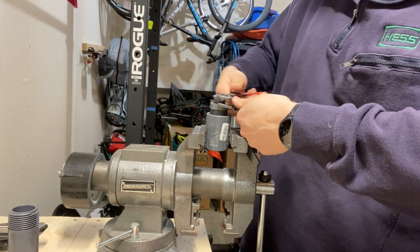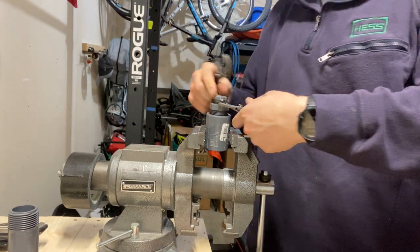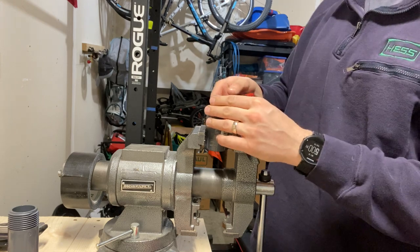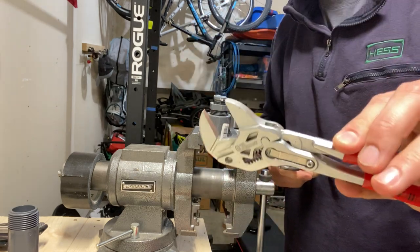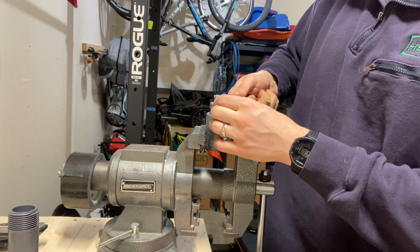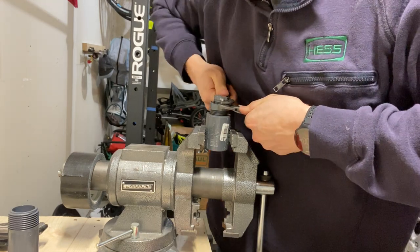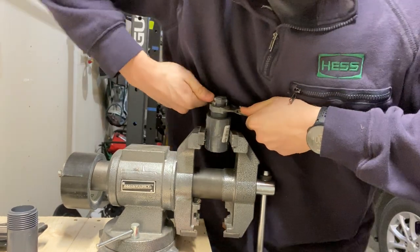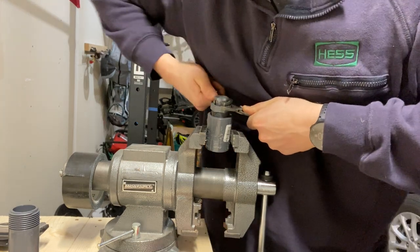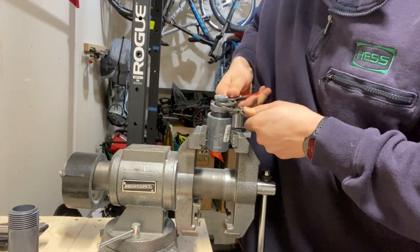This is a case where I've tightened it down so much that the plastic hex can't support that style of jaw. Where we're at with this fitting is I'm going to have to grab the threaded area — something you could not do with the plier wrenches. So if your hex is all screwed up, I'm grabbing onto the threaded area and I'm able to break it loose even though the hex head is totally trashed.